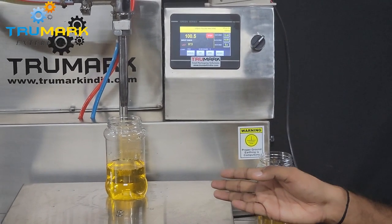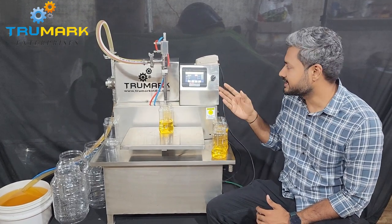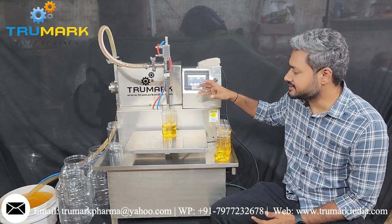This is a 5 kg load cell, so 0.5 to 1 gram is the tolerance of the load cell — and that tolerance we can set. Calibration can be done with known weights, so the calibration feature is there and the tolerance feature is there.